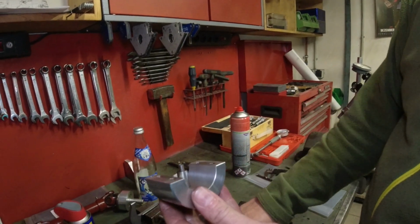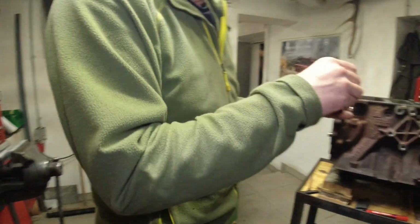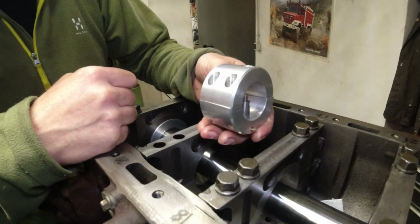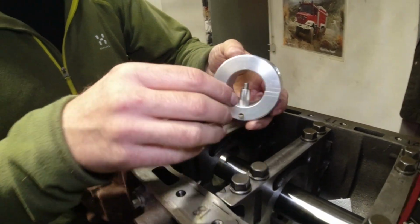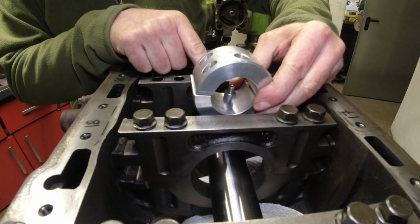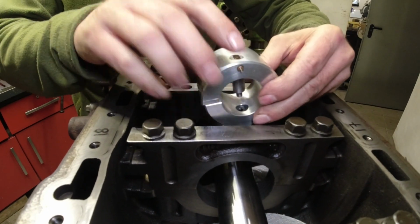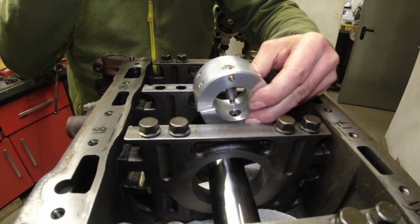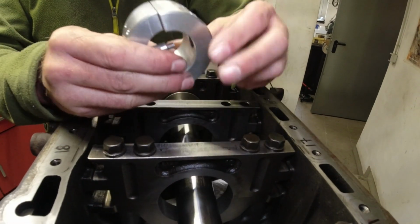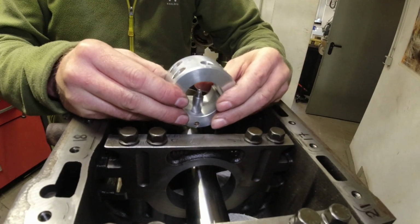And the pusher, of course, has to fulfill the requirement that you can adjust it while it is installed in the engine block. This goes in there actually like this. My cutter sticks out, and then I can still get my Allen wrench in here by turning the lower set screw up like this. I can increase it, for example, 1/8 of a turn, and then I lock my cutter down into place using this set screw, and then I can do the next machining operation.